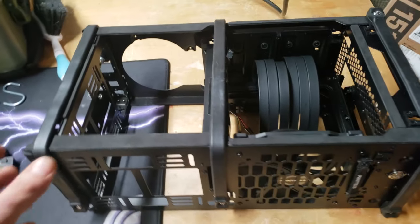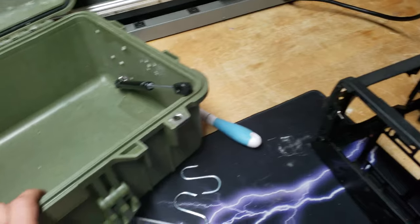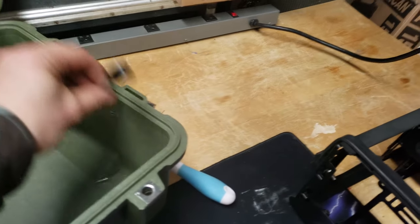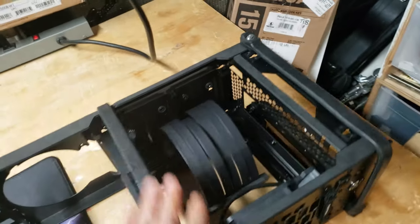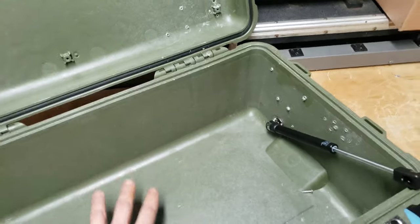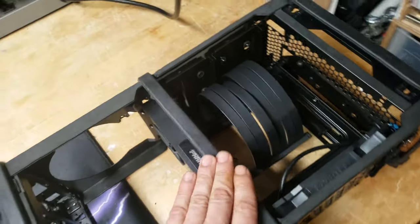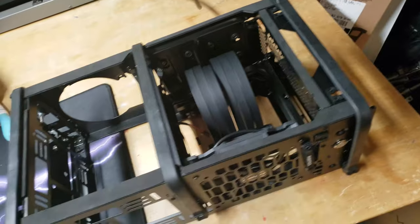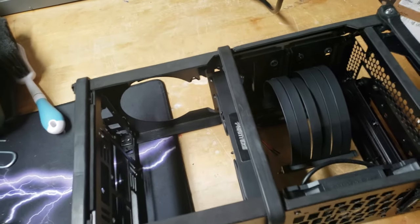Okay, just some elements of the modded chassis I want to highlight before I enclose it in the other case. Other than the pneumatic hinges, we also have this rubber, put 3 strips along. That's because this is going to be pushing hard down against it, and while we have the hinges to support the bottom and give that some float, I want a little something here to give on the lid when you're pushing down on it, to not have it deform the chassis or anything.